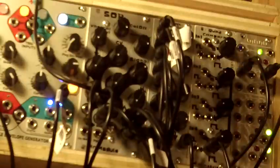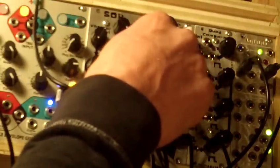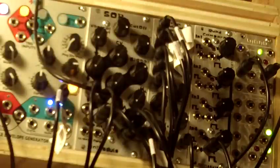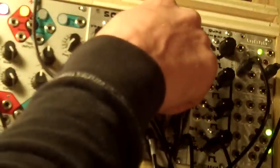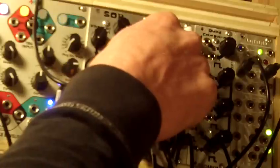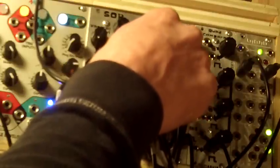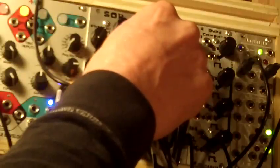I'm going to set it on the band pass for this demonstration. At its heart, it's a state variable filter. Now, before the state variable filter stage, there's a wave folder stage — you can mix your signals through a wave folder. Turn the wave folder all the way up and you can hear the harmonics get added in there.